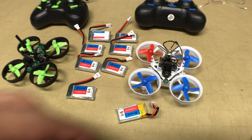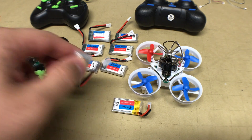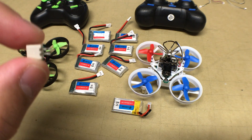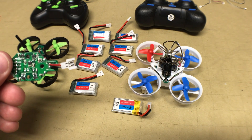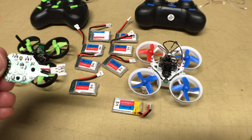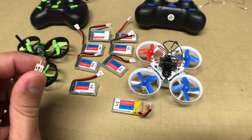If you look closely, you'll notice the battery that comes with the E010 and E011 has a different connector type than the aftermarket 260 milliamp hour batteries we purchased, which use the Micro T connector. You will need to make some adjustments to use those batteries. What we did is remove the stock connector from the board and install an adapter, so you can still mount the camera on the top side of the board and the battery on the bottom. One thing to keep in mind: removing the connector is a hard job with just one person, so get an extra set of hands if you can.